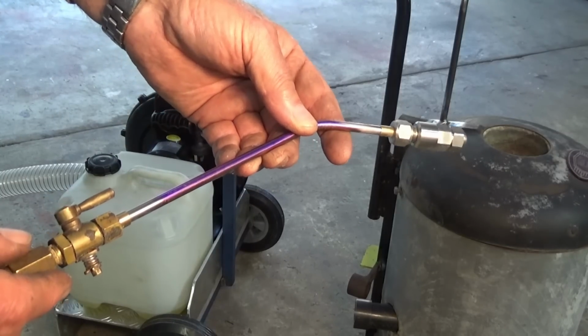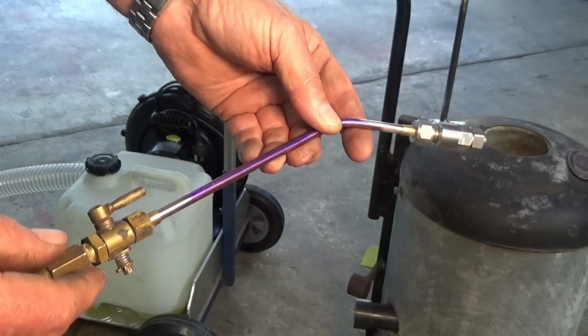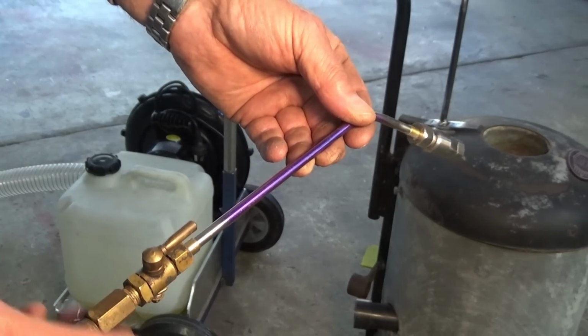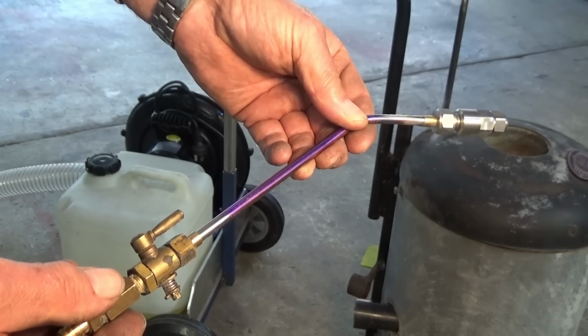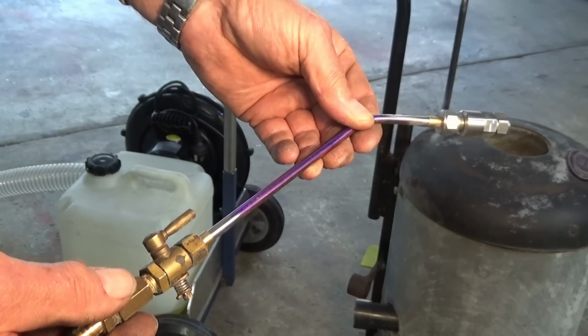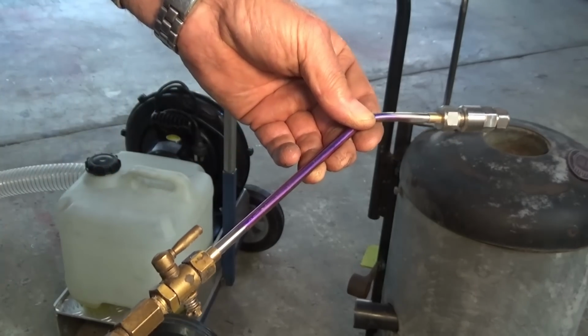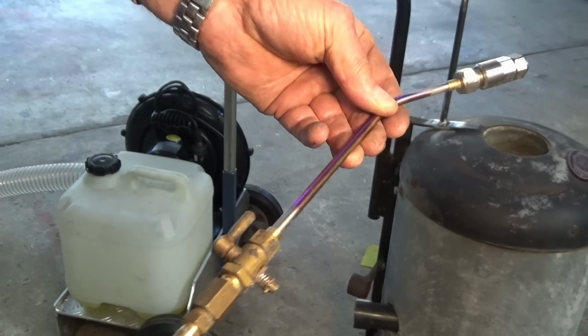While I've got the Hossfeld bender set up, we need to get the second bend put in this fuel delivery tube here, and I've got a couple of bending dies made up for doing that. And then we can do a trial fit and see how this is going to assemble inside the burner tube itself. So let's do that.